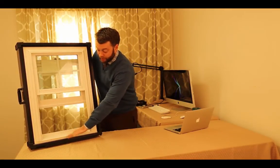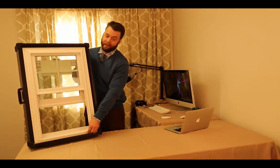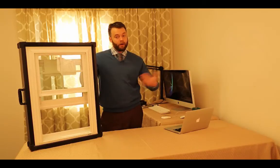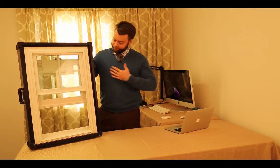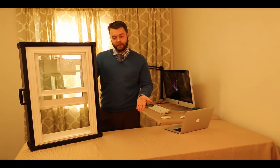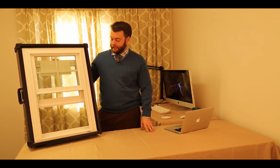You do have a fully sloped sill and a nice big fat bulb seal on the bottom, plus weep holes on the outside to drain any water that comes into the frame. The drawback is they can get clogged with leaves or debris, causing water to back up and leak inside. Most newer window designs have a fully welded sill so there's nowhere for water to get in. Looking at the outside, the screen track does look nicer than the 5500 — more like it's part of the window. But overall, Simonton's products are equivalent to a 10-year-old design, and until they upgrade, they're just not the latest and greatest.